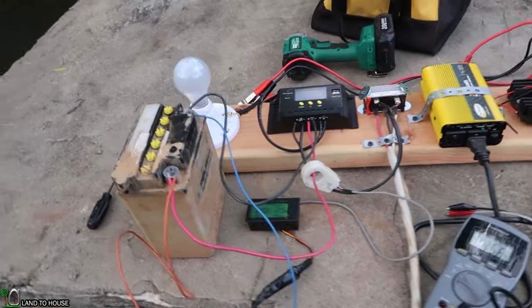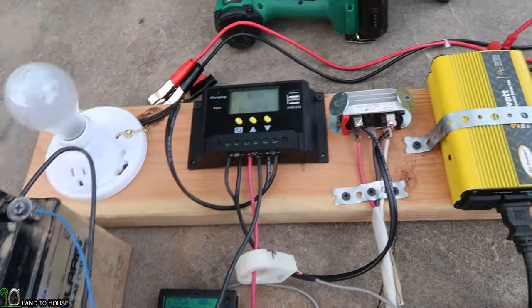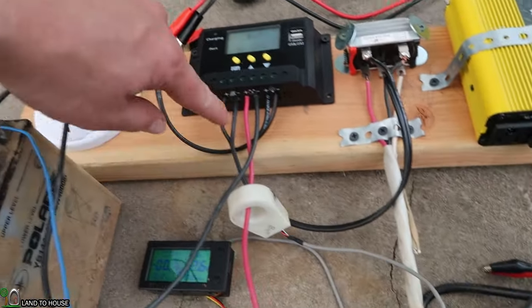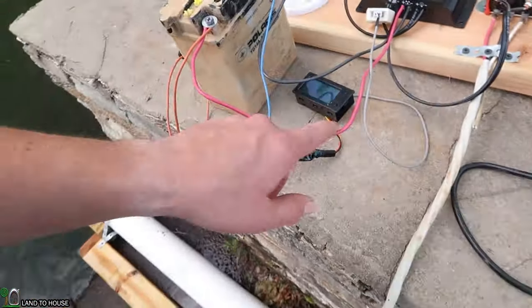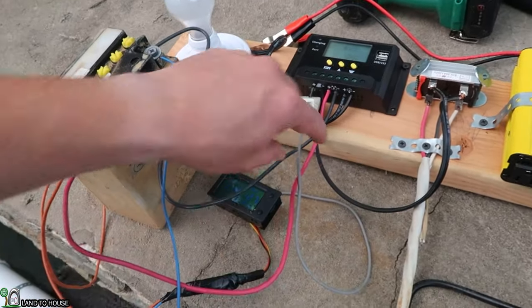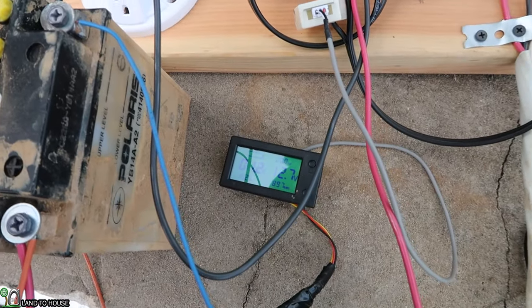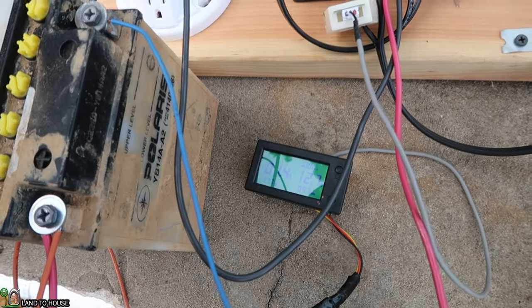Okay, I think I have things set up wrong. So this value is the 12.5 of the battery on both of them. This clip needs to be on this leg right here of the source. So let me swap that to that. Okay, that was the problem. I just swapped over from reading the battery voltage over to the input from the rectifier. So now what this is doing, it's got 1.4 amps and 12.7 volts coming in. For 17.7 watts, I've seen it up to 19 watts.